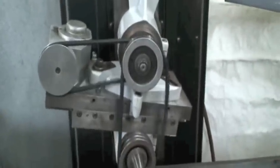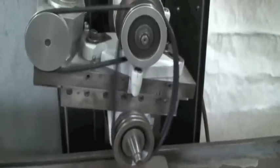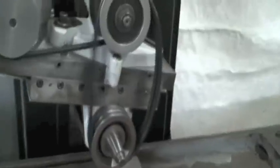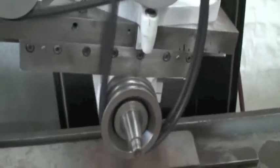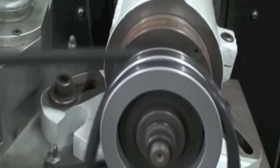We're going to go ahead and start it up and show you how it works. It's driving off the spindle of the surface grinder. The stroke is adjustable — right now we have a slight incline to it. If we straightened out the mount, it would go horizontally straight across parallel to the work. There's also the ability to get a swivel out of it for tapers.